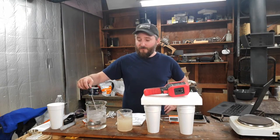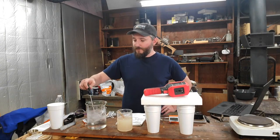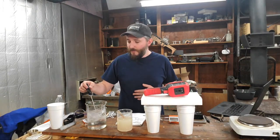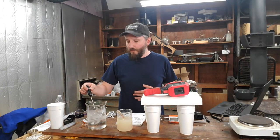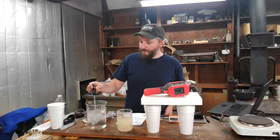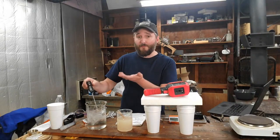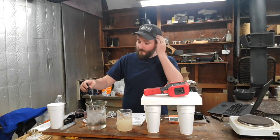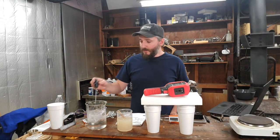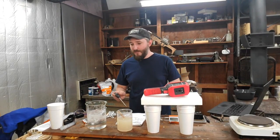It should always be exactly 0 degrees Celsius, except if there's any contamination, any little bit of salt in the solution, it can be a different temperature. But the water and the ice will always be the same temperature. And so we know what temperature the ice was. It's exactly what the thermometer says it is: 1 degree Celsius or 0.8 degrees Celsius maybe, because there's a little bit of mineral content in the ice.